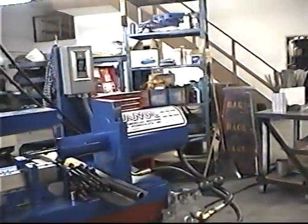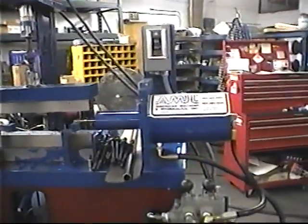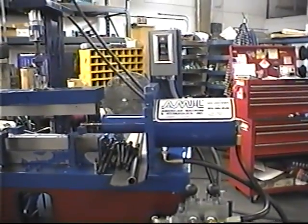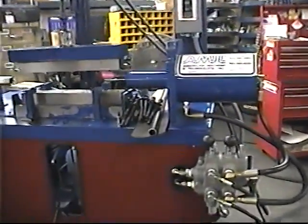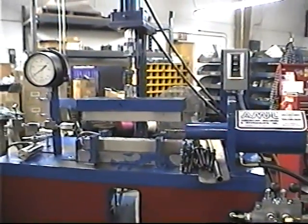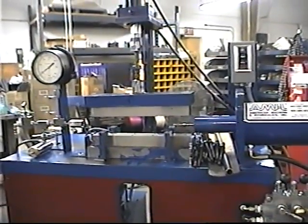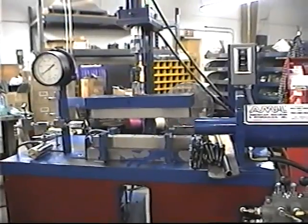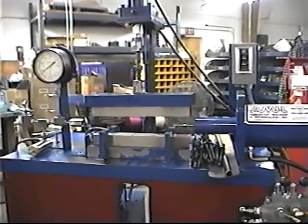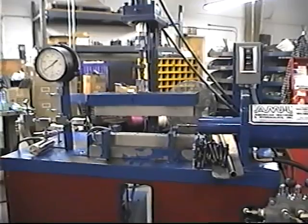This is a specially designed system by AMH — we produce our own cylinder and make our own chamber for compressing the water to form the bellows for the convoluted tube. These are EGR tubes that we're making for GM in a helical fashion or design, not annular. So it's pretty tricky, but the forming is coming out pretty good and the die marks are very minimal.